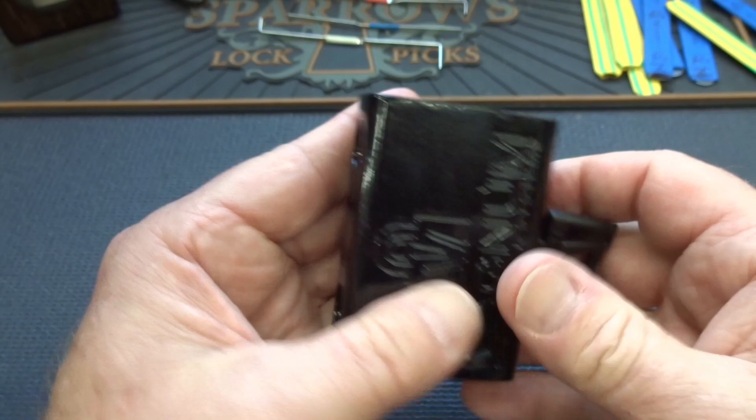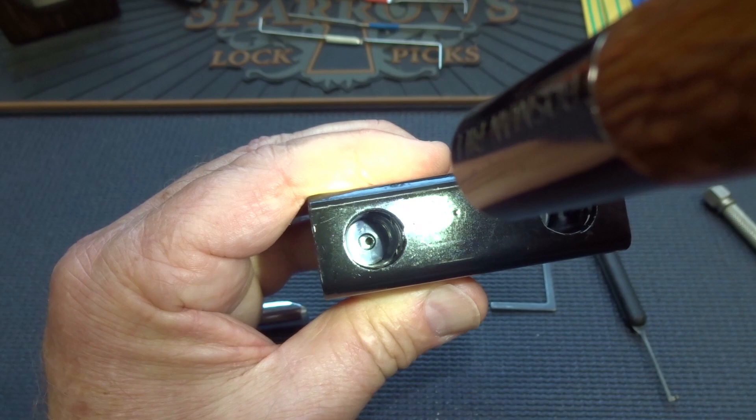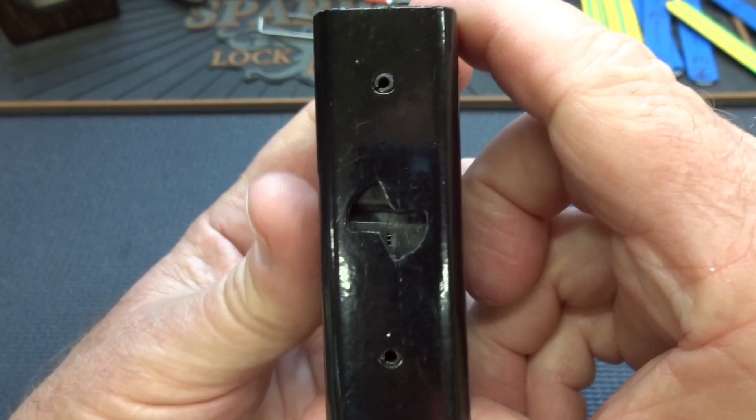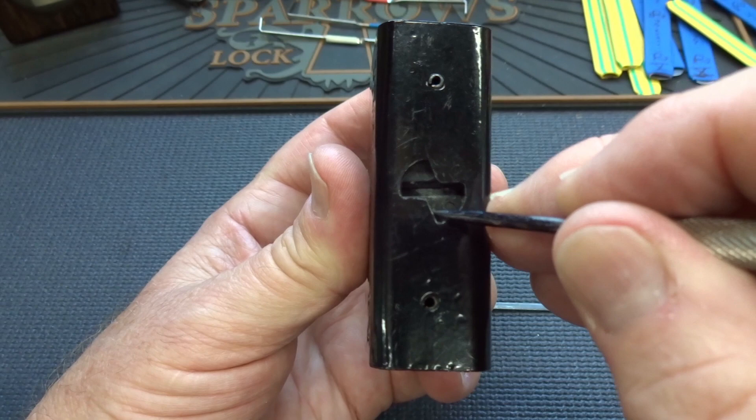Let me show you one thing — the flared-off roll pin. Let me grab a light here. If you look down in there, you can just see the roll pins on both sides. No screws or anything to do a disassembly, unfortunately. Now, the big part of the battle with this lock is going to be this shutter. Because these are not independent — when you push down on this side, notice it pushes the other one up. These are working together to prevent us from getting in here.